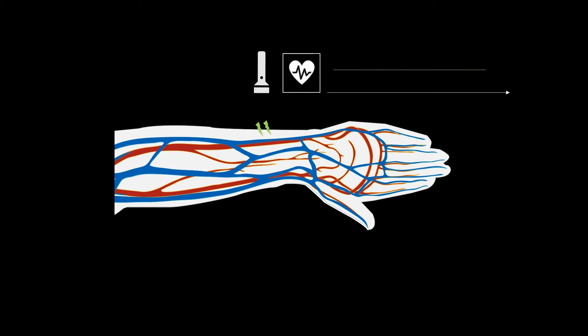If there is no pulse, the amount of reflected light will be constant. However, as a wave of blood propagates throughout your veins and under the sensor, more light will be absorbed by the increased amount of blood, and we can see a change in the reflected light.